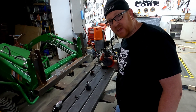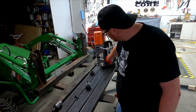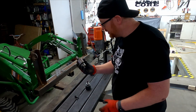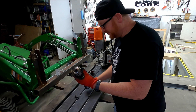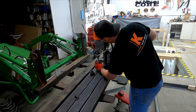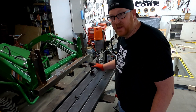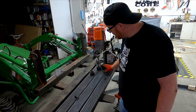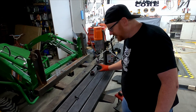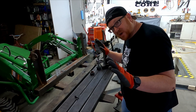One of the disadvantages to having the magnetic drill press is the throw isn't very long, so when you start stacking up an adapter and the length of the cutter, it may not fit. But we can stack up other pieces of metal to clamp down and then set this up on different heights to get it to work — no problem.